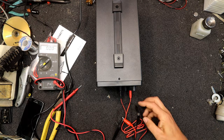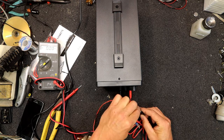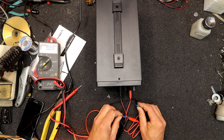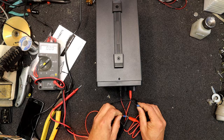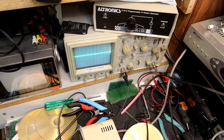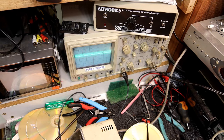You really need to shield your leads and stuff. I could be picking up any rubbish at the moment — it may well be that I'm actually picking up some sort of external signal. What happens if we load this thing up? Nothing really — actually yes, there is a bit more. I guess that's a test of the power supply. So normally there's a little bit of ripply stuff, and when I hook up this lamp I'm getting a bit more jitter on the screen.